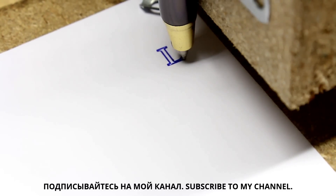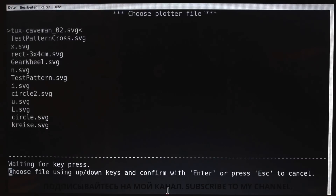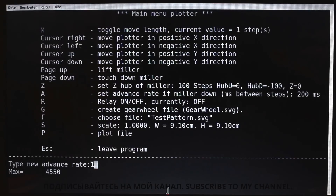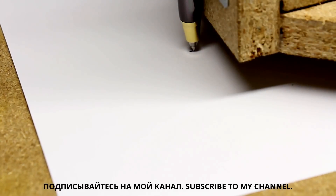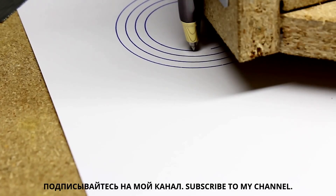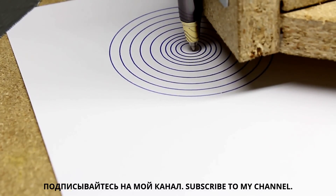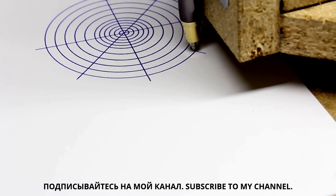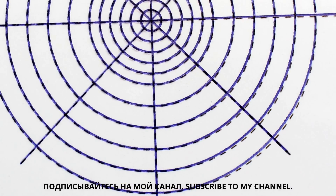With the reduced gear ratio, VL is plotted in less than 50 seconds. The software on the host computer runs with Linux from the command line. With that program you can choose a file and set some parameters. The software processes scalable vector graphics with all paths turned into line segments. The test pattern consists of some concentric circles and four lines arranged with an angle of 45 degrees between two paths. The plot is compared with that pattern printed on a foil using an inkjet printer. There are noticeable deviations, but considering the simple construction, the result is not too bad.